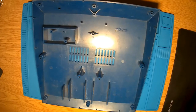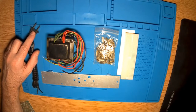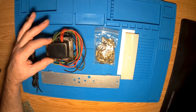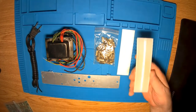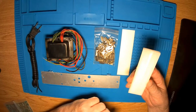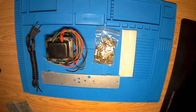I'm not particularly worried about the case damage — I might try to make it a bit more secure since it's going to have mains voltage in it. When the kit's finished you won't be able to see anything in terms of the labels — I'm sure I'll be able to either print them myself or get them made. Here's some of the hardware: we've got the mains cord — I think that's American. We've got the mains transformer which can be wired for 110 or 240 volts, and that's covered for both in the manual. We've got the mounting plate for the power regulator, and a small breadboard into which we have to manually insert strips — apparently a few of those are missing.